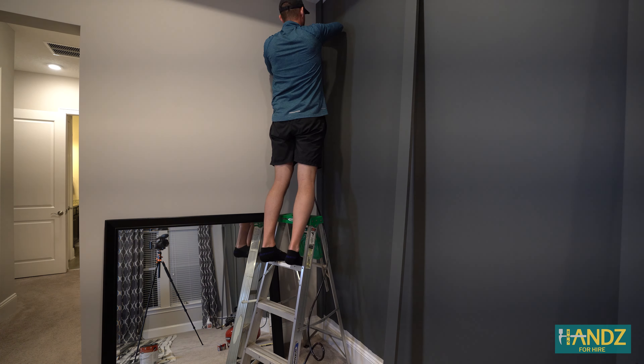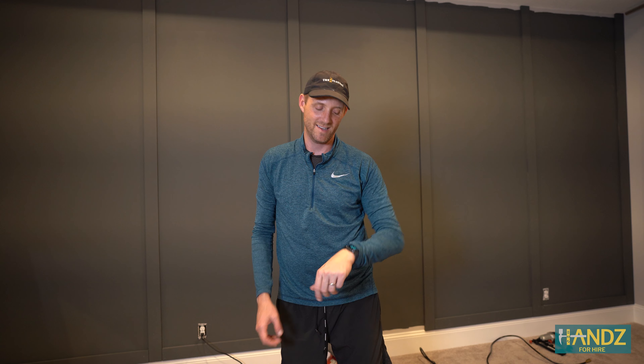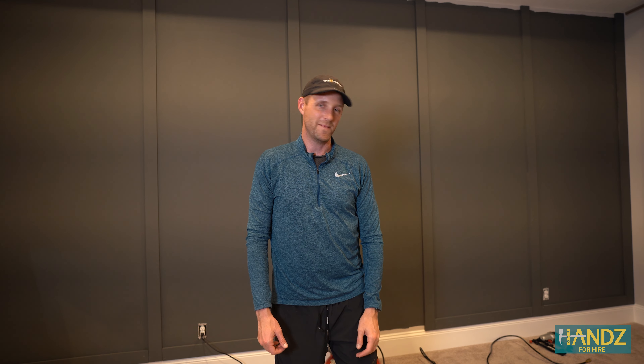It's been about 10 hours since we painted the wall and we are ready to attach the boards. I'm going to be using liquid nails — coating the back of each panel — and then follow it up with finish nails. You can use a brad nailer, but I'm going to use two to two-and-a-half inch nails to staple everything in. One done. This is where the measuring starts. We need to measure 39 inches between each board. I did three marks 39 inches from the other board, then I'll check once the board is up and move it slightly to make sure everything is level.